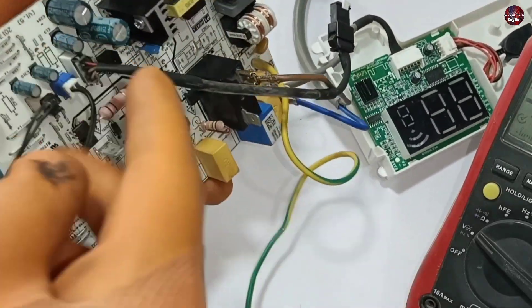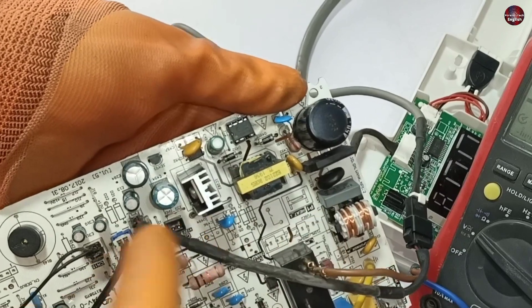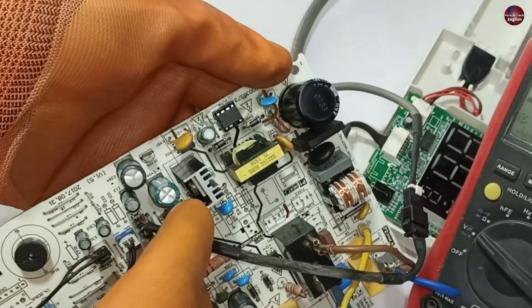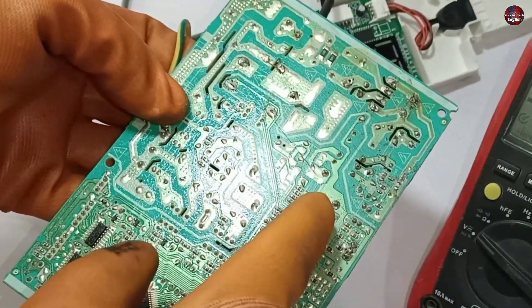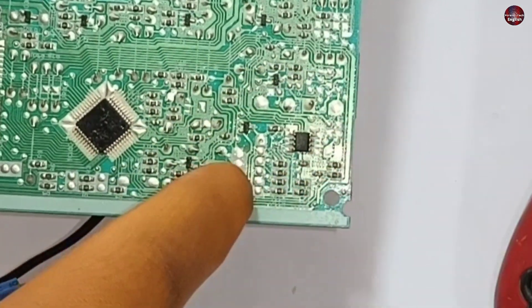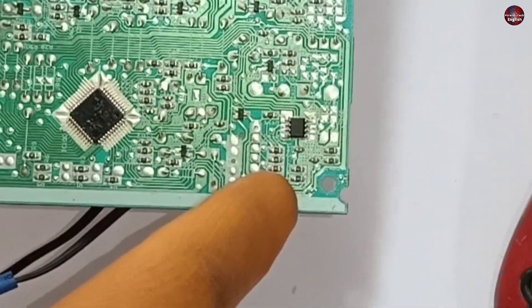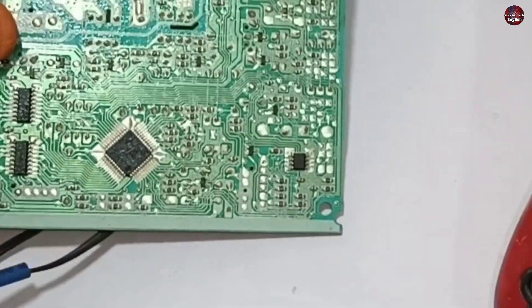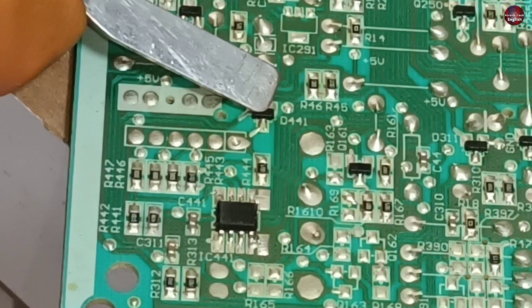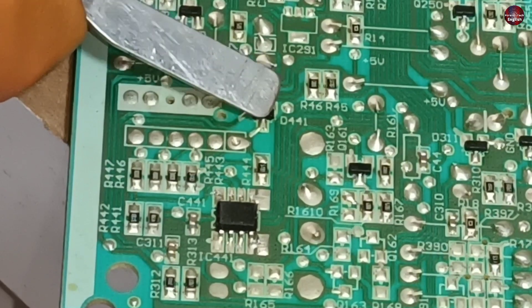The other repair guy had worked on the low voltage side of this PCB board, which are the 12 and 5 volt circuits. This area of the motherboard is not bad. The area where the work was required to be done is this — you can see the EPROM is installed over here. I will check the voltages here. 5 volts pass through this diode 441, and if it goes bad, then this could be the cause of this problem.